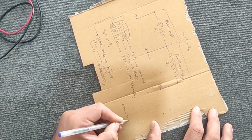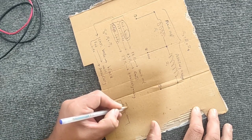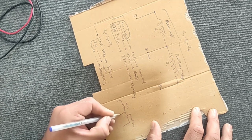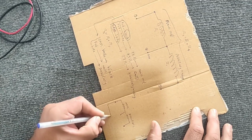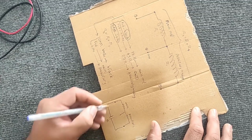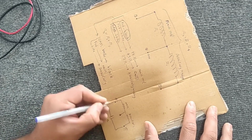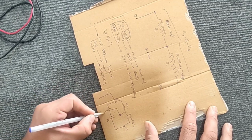Now we teach the wiring method. For that, we place a capacitor between the base 1 and 3, means between the red and white wires in parallel, and we connect the phase and neutral wire to the main coil and the common base.